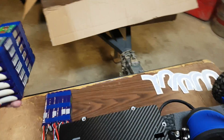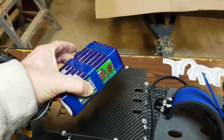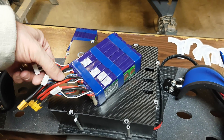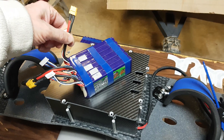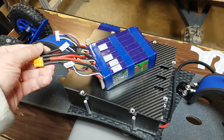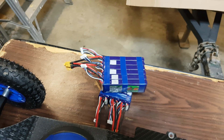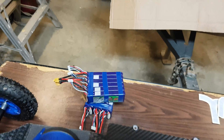For now I'm gonna use these battery packs — these are old 3-cell batteries I had a while ago that I used to use on my bigger drones. What I did is I made two of them in series, so these are actually 6-cell 2600mAh cells, three of them in parallel, so that gives me almost an 8000mAh 6-cell. I have two of these packs, so this is gonna equal about an 8000mAh 12-cell pack. We'll see how long that's gonna last.